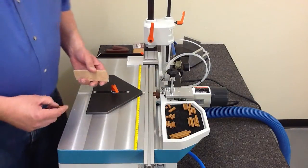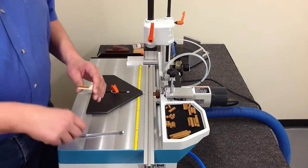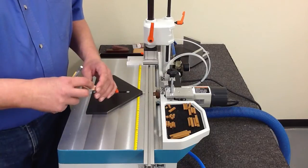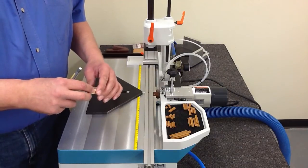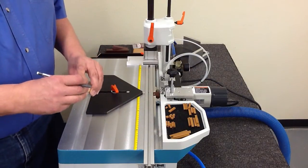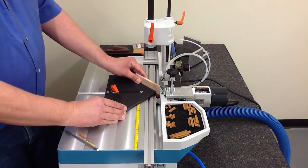Okay, we start here with the small molding. What you want to do, we're using a W-1 30mm or 1 3/16 key. The molding is about 1.5 inches tall. And what I'm doing is I'll set the key on the miter, and I want to leave about 1/16 of an inch gap or space here to my inside edge. So I'll simply set the key here, and I can mark the center of the key on the back. In this case I'm marking it on the back side of the molding because with my center line finder I can now adjust my center plate right to my mark.